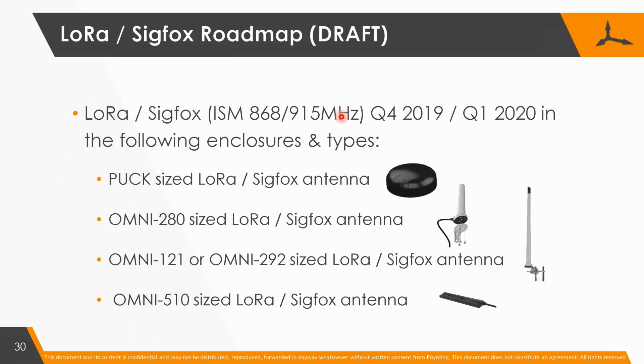That's the LoRa roadmap. We're going to do all of these antennas — many of them that you're familiar with — but specifically optimized for those LoRa frequency bands. It's a lot more effective because at the moment they're doing the LTE range which goes from DC to light, and there are compromises involved. We believe custom ones in this range will come out soon — Q4 or Q1 2020 — which would be an excellent solution, as they would perform a lot better in that frequency band. They don't need broad bandwidth because those standards are very well defined for those frequency bands.